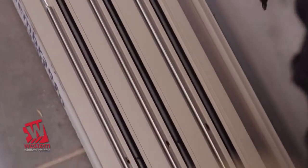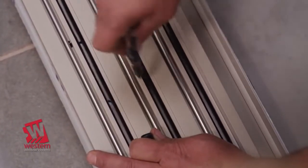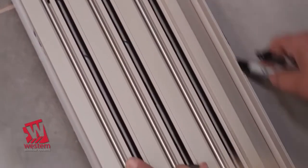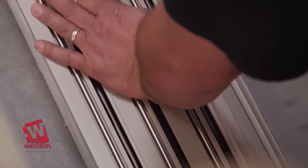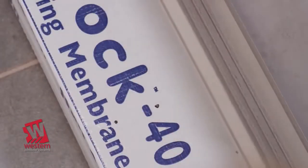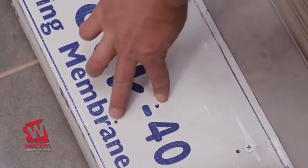Mark the inside edge full length and across each end sufficient to locate the inside corners. There are installation holes in the weather strip channel of each additional track that align with the countersunk holes. Beginning with the holes in the inside track, mark the floor through each hole. Remove the threshold assembly from the opening.